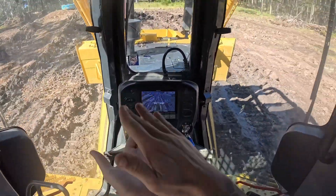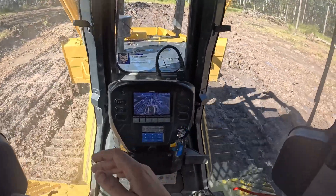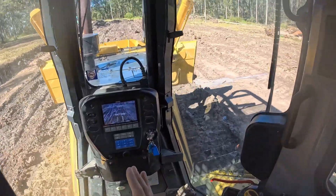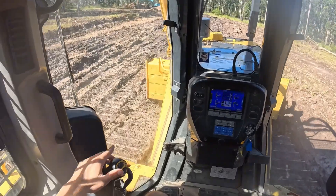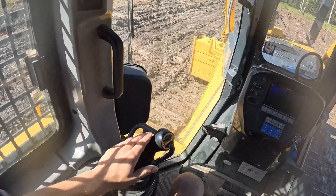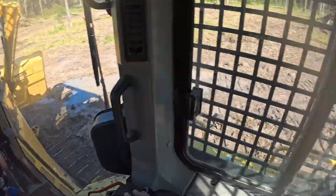Coming up to this stage, we're going to hit rocks and boulders that are going to throw the dozer out. It can get frustrating, but don't let it frustrate you. If you really get stuck, you can rip and push it up with the rest of your topsoil, but I prefer to keep the topsoil and the rock we're cutting very separated. I don't want any of this grey dark soil mixed with the lighter-coloured rock, because it will make the pad an absolute mess. Those rocks underneath are going to throw your blade out of line, but once you get past those rocks it's completely flat. Don't stress about it — you're going to rip that anyway.